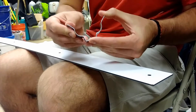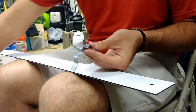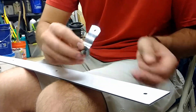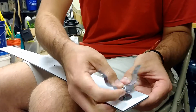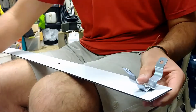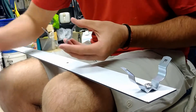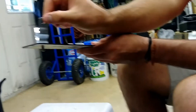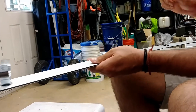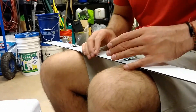Take a stainless steel conduit hanger and widen it with your hands. Insert a ¼-inch stainless steel hex bolt into the conduit hanger with a stainless steel ½-inch flat washer on the other side. Insert the trio of parts into the back side of the staff gauge ruler. Repeat this for the three other holes in the staff gauge ruler. There are two different hole shapes on the conduit hangers; twist the conduits to line up the same hole shape, though there isn't a specific side needed for them to line up on.